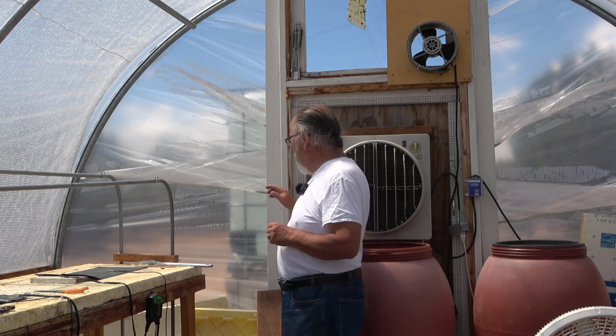On the other side of the door, and that's the plywood bulkhead that the evaporative cooler attaches to, I'll put a 1/4 inch swivel on the end of that PVC pipe. So I'll run that then to the swamp cooler, evaporative cooler. That should make the system a lot more robust. Right now I'm using a piece of clear tubing that's commonly used around here to connect house water to an evaporative cooler. One of the problems with it is that it breaks. It breaks here because of the high altitude we're in. That really takes its toll on a lot of plastic products, so we'll make sure that that's replaced with something that's not likely to break while we're gone.